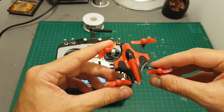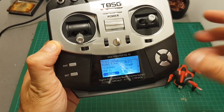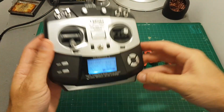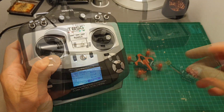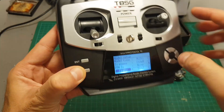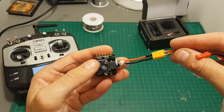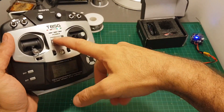The best way to check if your quadcopter is compatible is to look through the instruction manual for your model. For example, to bind the Eachine E010, choose the MJX protocol, press Enter, choose the E010 format, press Exit, turn on the quadcopter, then press Re-Init — now it's bound. To bind an FrSky product like the mini quad, choose FrSky — don't confuse it with V8 or X — hit Bind, then connect the battery while holding the bind button.